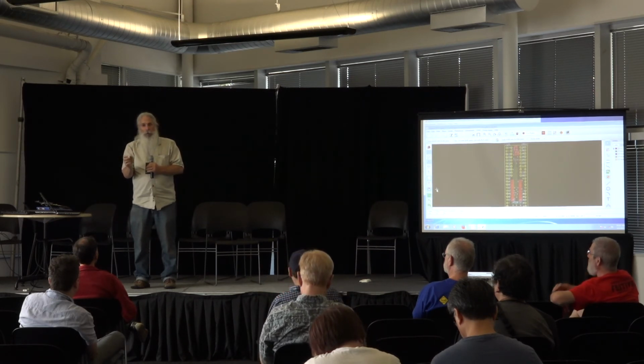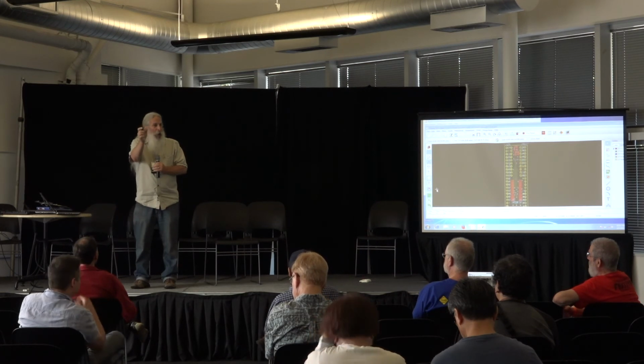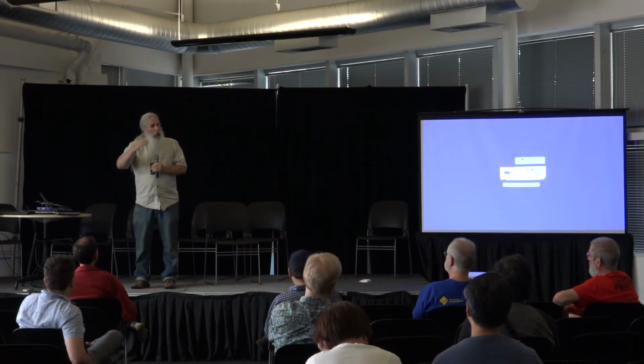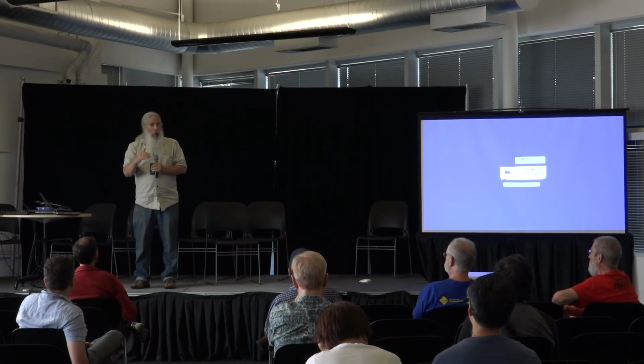I define a segment, so I might define a segment called main code, and I might define a segment called NMI reset or interrupt vector. Then if I use that name, it's assembling code in that particular area, and I can switch names back and forth. It keeps track of where it left off the last time I was using that area name. So it allows you to do all your forward references where they're explicit addresses.